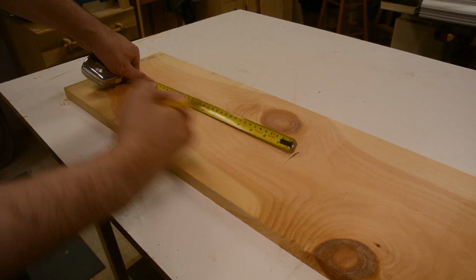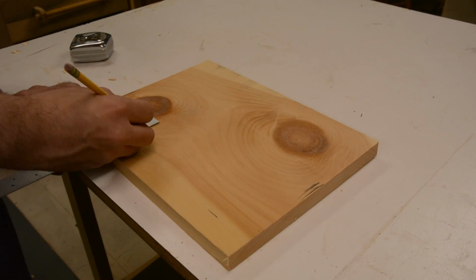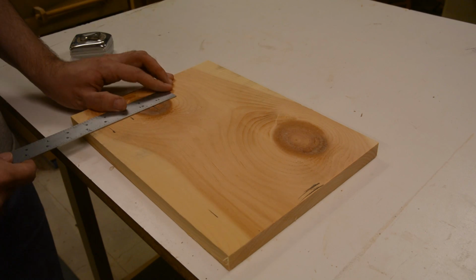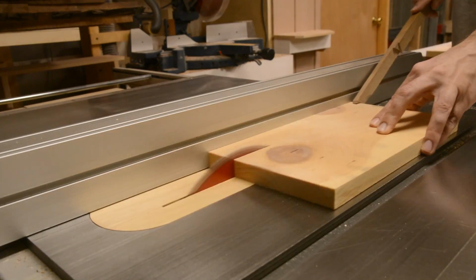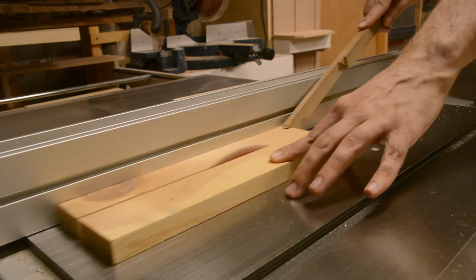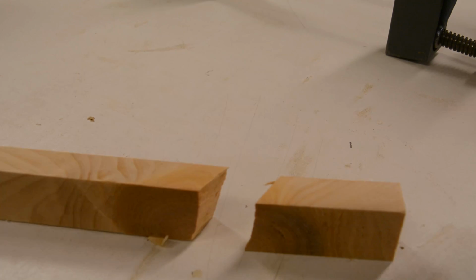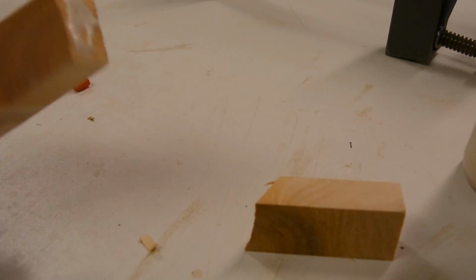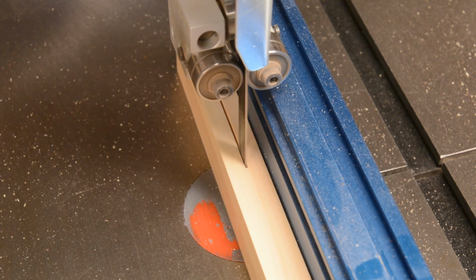I thought about making some deeper drawers by keeping the knots intact, but I decided to cut them in half. Now what I should have done when ripping the drawer fronts was to leave the last one long, so I could cut it to fit the actual size of the cabinet once that was made, but I got carried away. I had to glue one piece back together, and then I could resaw. I could have done the resawing before ripping, but why make a wide resaw if you don't have to?